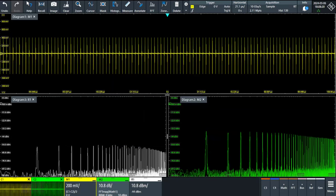So you can see at what frequencies the dominant effect is differential mode, and at what frequencies the dominant effect is common mode. And this is very important because then you can separate in a separated way to design the common mode filter, common mode chokes, Y capacitors, and the differential mode filter, X capacitors and differential mode chokes.